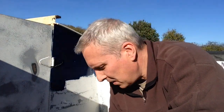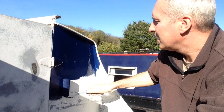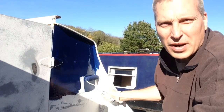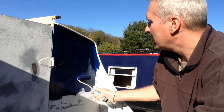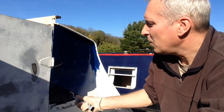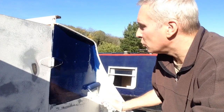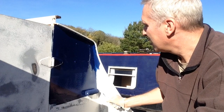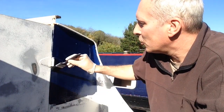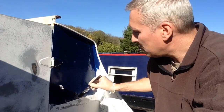Let's have a look at the top tips for painting a boat. Other than the very obvious — like try and get the best equipment you can, relax into the job, don't get too upset with doing it, and just try and take your time — preparation is the most important thing. How you clean down the metal or the surface before you start painting has a massive impact on the finish. If you've got weld marks or dents in the boat, painting will never get that out. Scratches and loose paint is the worst thing — if you put new paint onto old loose flaky paint, it will straight away start lifting and will show up immediately. So do make sure the surface is as good as you can get it before you start.